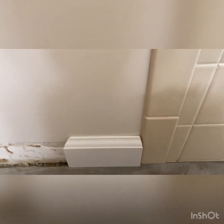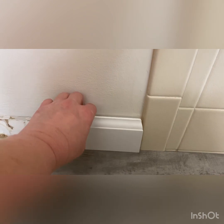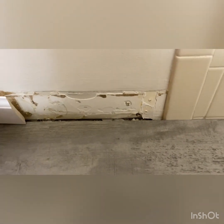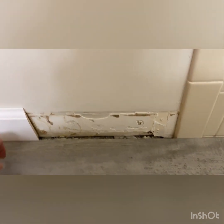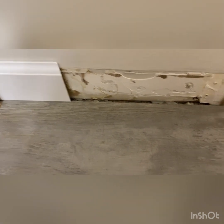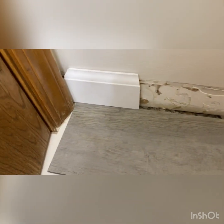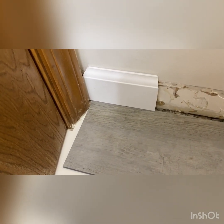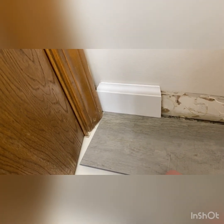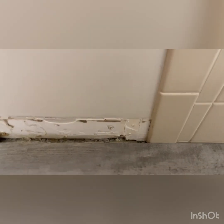But this is gonna look just fine. It's flush up against the bathtub, and my baseboard width is gonna hide everything all along, even into the corner. We're gonna be just fine. It's gonna hide the gap. So we're gonna be good there. So that's good news. So I do need to undercut that trim piece right there, the door trim piece. I'm gonna undercut that with a saw so that this piece will slip under it, and that'll look really nice.